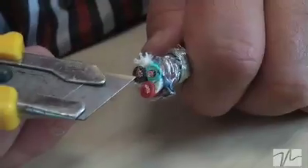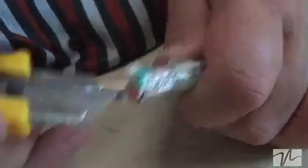The three conductors on the inside are still right against each other. So this cable would have relatively decent protection on the outside against outside magnetic interference, but between the ground, the hot, and the neutral, there doesn't seem to be anything protecting them from each other.